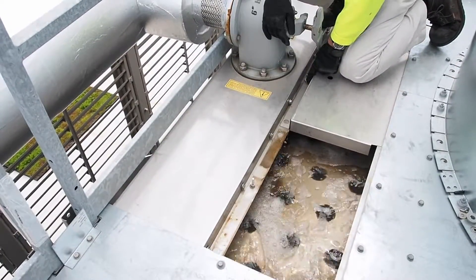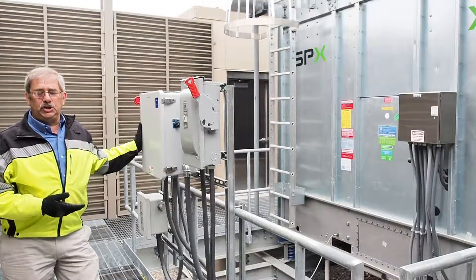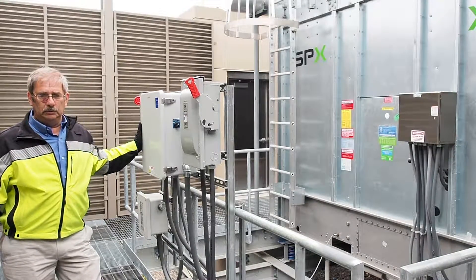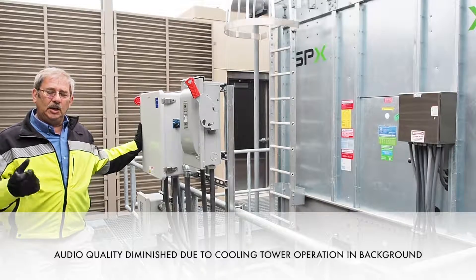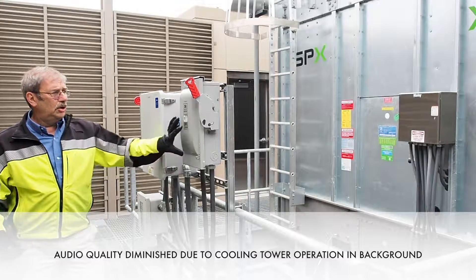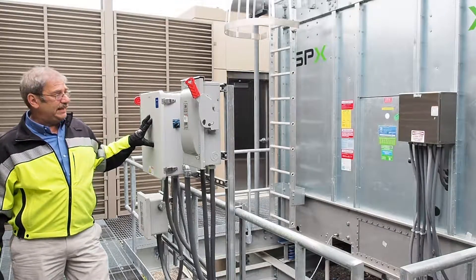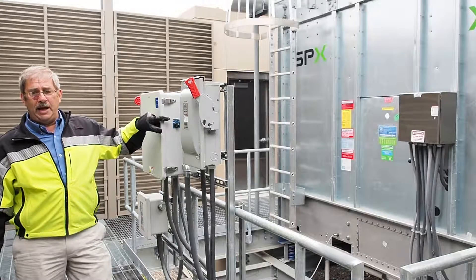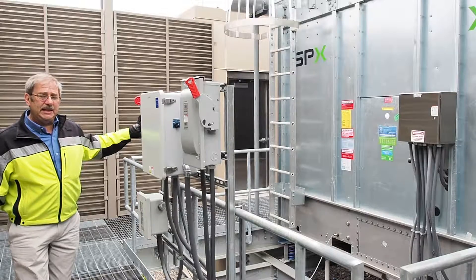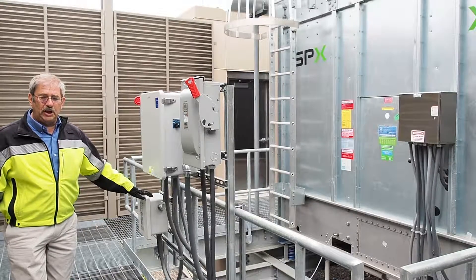Never leave the cover off — covers are held in place by wing nuts and should remain in place at all times. I would like to show you the electrical devices for the second cell of the SUNY Binghamton cooling tower. We have separate systems for each specific cell: fan shutoff disconnect, liquid level control system with a separate HOA automatic and hand switch, disconnect for the basin heating and control system, and our basin heating control panel for cell number 2.